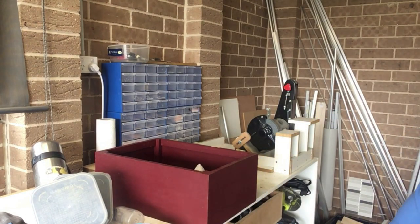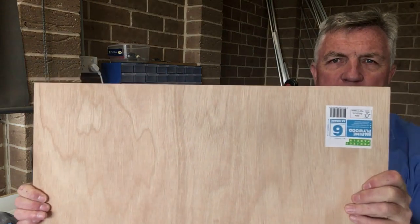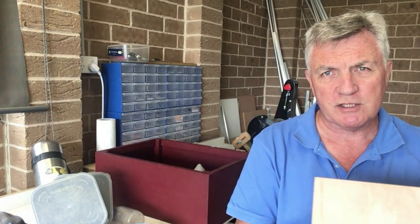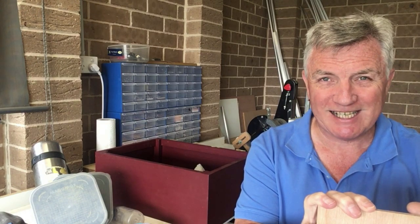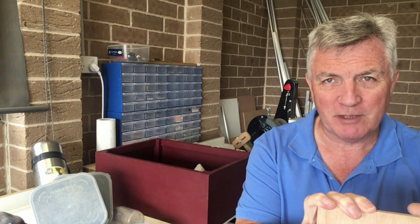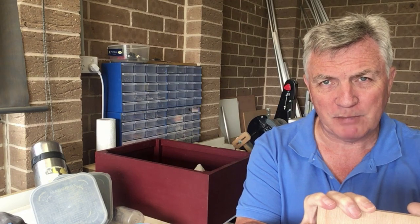It's going to be cut out of 6mm plywood. As you can see, it's not a huge piece — from the local DIY store, fairly cheap. I've used marine grade — it is a bit heavier, but because it's marine grade, if it does get wet constantly it's not going to blister and fall apart. Having said that, we're going to finish it off with paint anyway, so it probably should never have that issue. I just like to do belt and braces on these things.